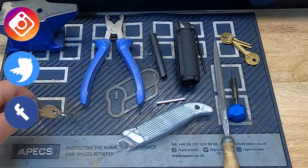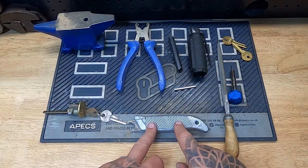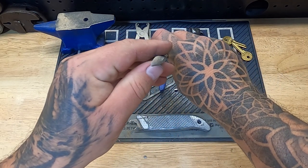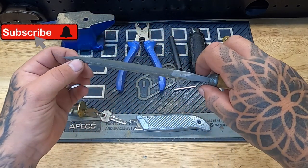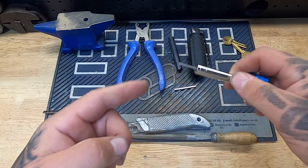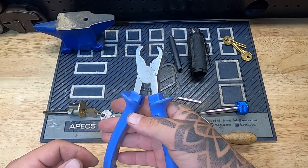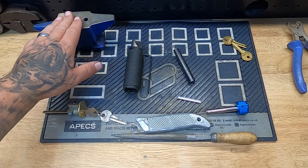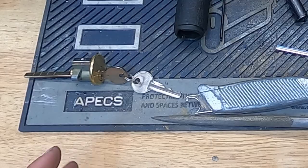I have the keys to this cylinder — that's all I've got. I've got a circlip remover, a pipping file — so a pipping file is like an aeroplane wing: thick and bulbous on one side and thin and sharp on the other, ideal for this task. I've got an old tool I've converted to a scribe, sharpened to a point. We have a shim, circlip pliers, an impressioning handle, a plug follower, and a small anvil. That's it tool-wise.